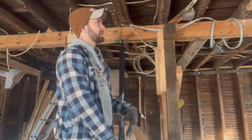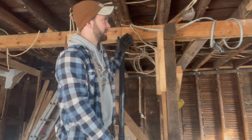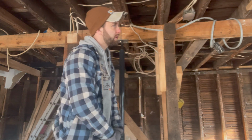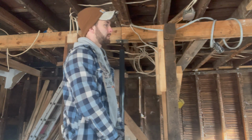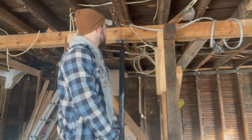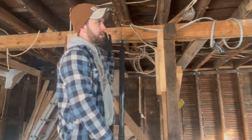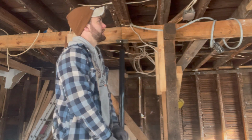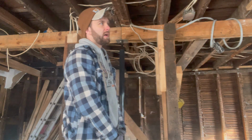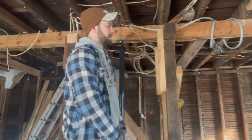But as soon as the floor is in, I can build a temporary wall and redo to hold all these joists on both sides of the beam and reset the beam or put a new one in. That's kind of why I'm waiting on the floor. That's why I'm excited about the floor. I'd like to get a whole new LVL beam all the way through and not even need this jack. But that's a big beam. And I don't know how to, well, I know how to, but that's a lot of support. Okay.